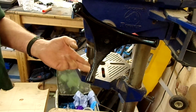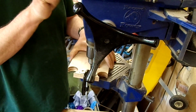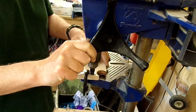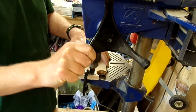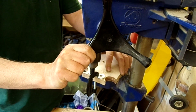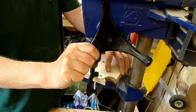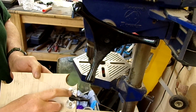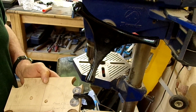Okay, so just countersinking, got a rose bit countersinking piece in the pillar drill, clamping two of these in at a time, and drill set at a low speed. So we'll try. There we go, countersunk about a third of the way in. That's all I want, so just a little bit more area for the weld to build into. So there's two done, six more to go.